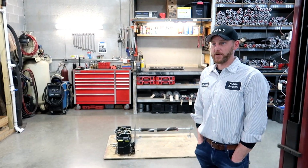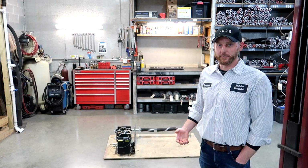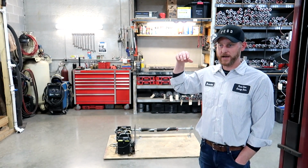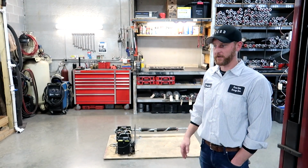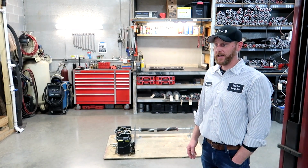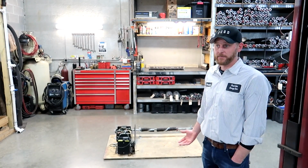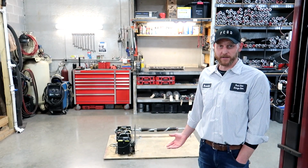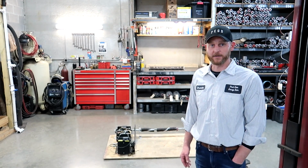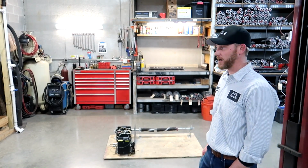If you do take it upon yourself to oil your door, if you need to get up on a ladder to do anything, don't oil the springs, don't touch them, stay away from them. If you're ever in the garage, if you have shelving around it or whatever, keep in mind these things sound like shotguns going off when they break. They likely won't hurt you as long as you're not close to them or touching them, but the noise will scare the daylights out of you, and you don't want to fall off like a 6-foot ladder because you'll probably hurt yourself when you hit the cement floor in your garage.